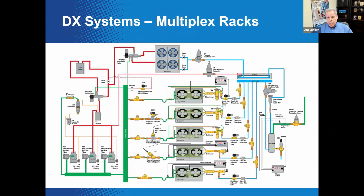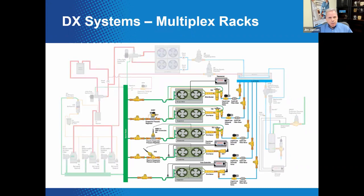Here's a more elaborate version of that vapor compression refrigeration system. We'll be discussing some specific components within the highlighted portion involving the metering device, distributors, and evaporators. The TEV actually resides right at the interface between the high side and the low side of the system.